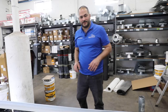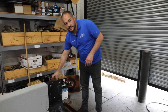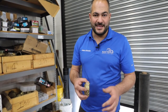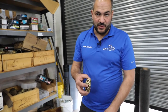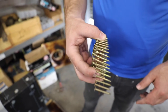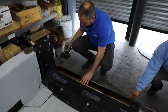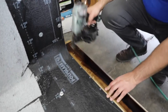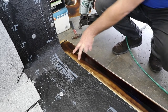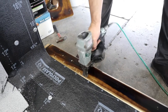We've got our low-rise flashing primed, prepped, and ready to go. We're going to be using electro-galvanized nails — you always want to use the same metal and not use corrosive metals when installing this flashing. Electro-galvanized works with aluminum and galvanized. These are inch-and-a-quarter round-head nails. You can use hand nails or a roofing coil gun. Install this with nails every three inches on center in a staggered pattern — that's how we're going to install the entirety of the flashing.